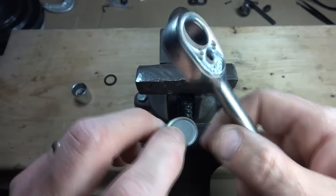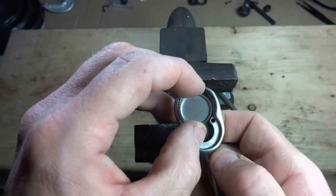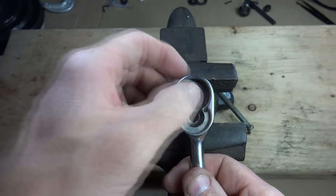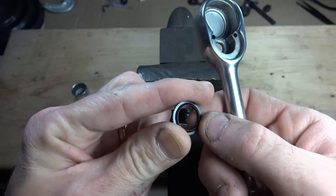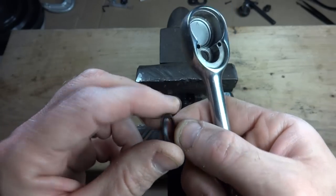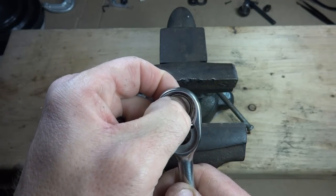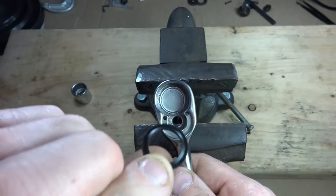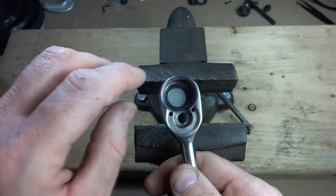There's a new little name plate, and that will go in there. On the back of the name plate there's a little red arrow, and when you set this inside here, that little red arrow is going to be facing up. Set that right in there. Then there's the little bushing — it's got little ridges along the edge, it's flat on one side and has a little lip on the other side. The lip goes down, so make sure you've got the name plate in there straight — you'll get one shot at this. Set the bushing in with the lip facing down and the flat side facing up.